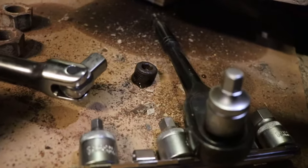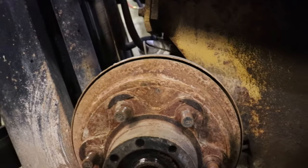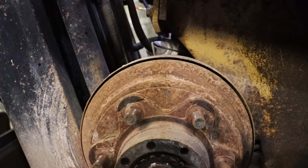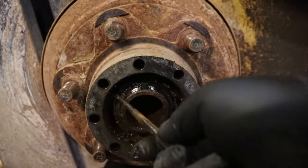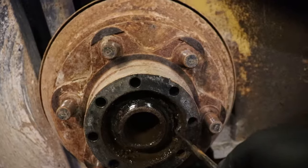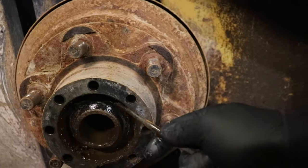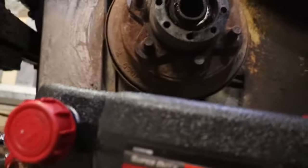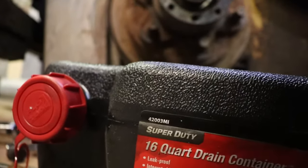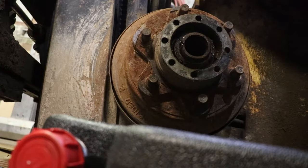It was a 10 millimeter to take the drain plug out. I knocked over the lock ring here — it was just holding the tab on this. I'll just use a chisel to get this started and work it further in. It looks like it's the same kind of deal in here — another one with four locking pins. Let's see if I can get this pointed in the right direction and knock it loose. Probably not the preferred way of doing it, but it's the tools I've got to do the job today.